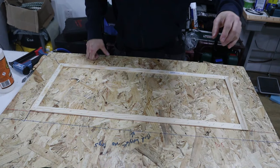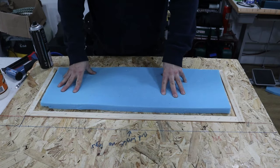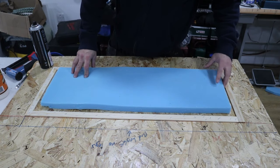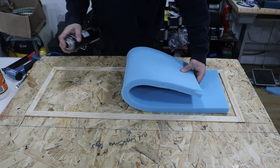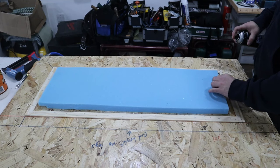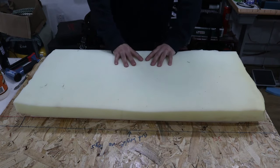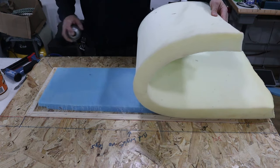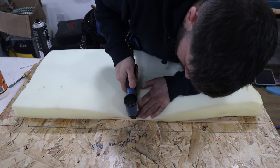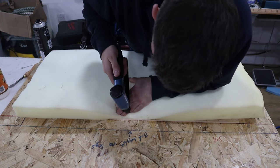On this headboard we want a nice little dome in the middle — similar to how we do dining pads or seats with a domer. This is going to make it a nice big luxurious dome. I'm finishing about an inch away on each side and just going to glue that down and do the same on the other side. You can use old scraps to build it out underneath. Then we go on top with our foam. Like we did with the bed frame, we can glue this down, then roll the foam off and staple on top of that edge.